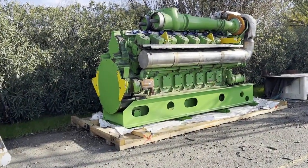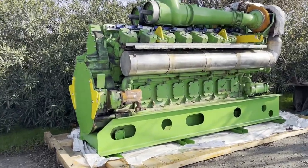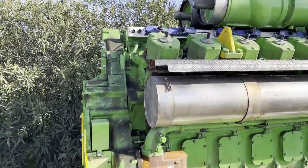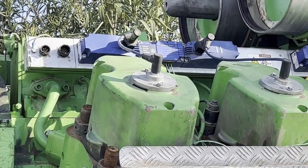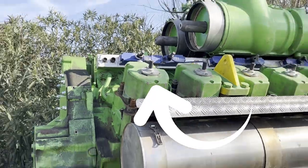This is one of the engines that got swapped out. You'll see where the spark plug tubes are on the top. You pull them out and then there'll be a tube that just screws right into the cylinder to do a compression test.